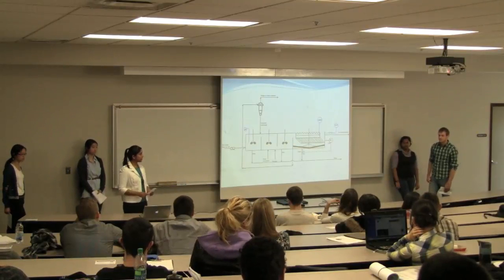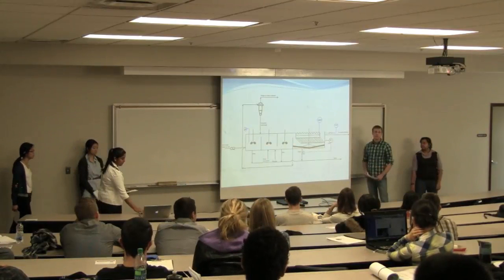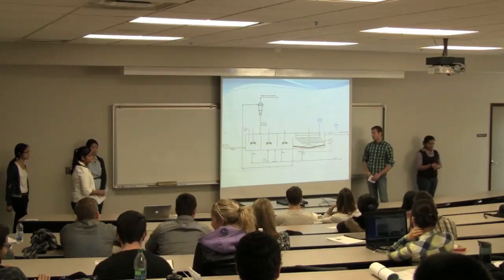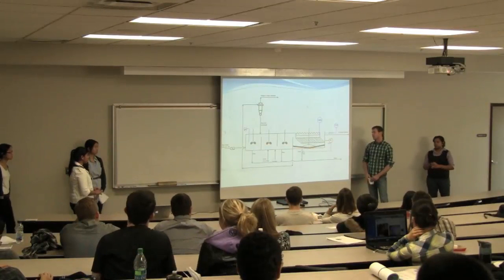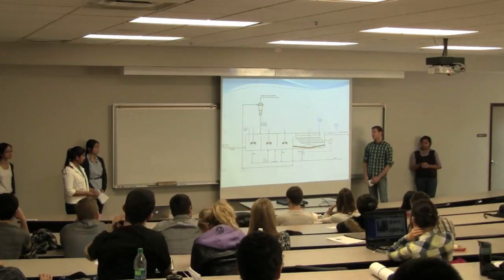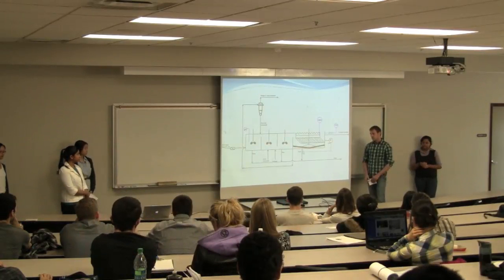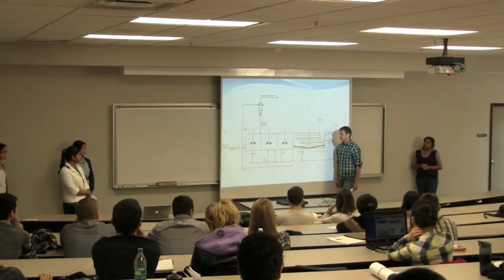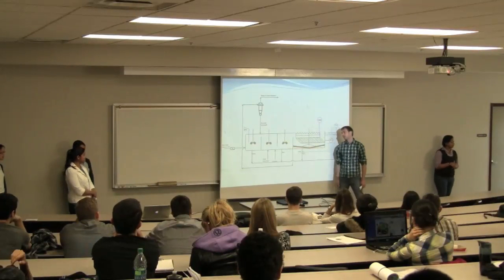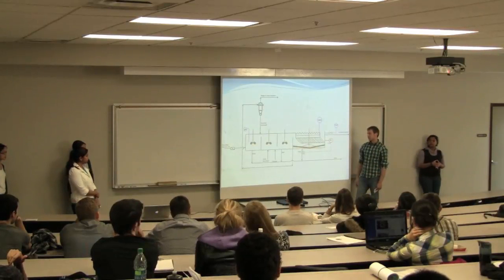And so this goes into our workshop. Our workshop is going to be a HAZOP analysis on the outlet pipe of the settling unit. The intention of the outlet pipe is to deliver partially purified water to the ozone contactors for disinfection. The deviation is going to be a turbidity level that's too high, so it won't adequately disinfect the water. A cause of this could be that the polymer and fresh microsand inlet isn't enough to adequately flocculate the particulate matter in the three mixing tanks.